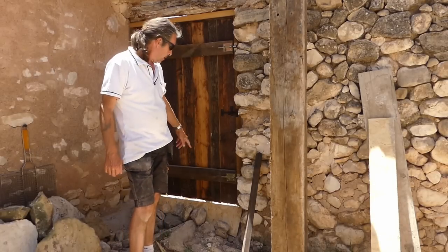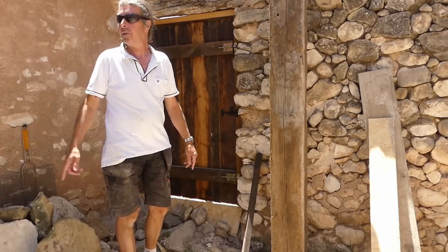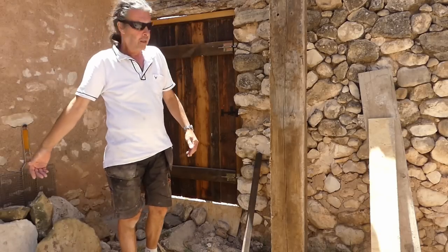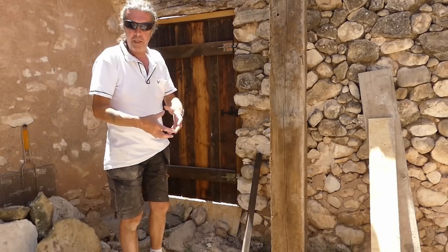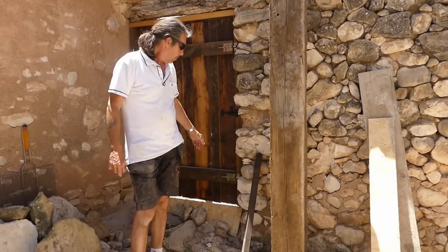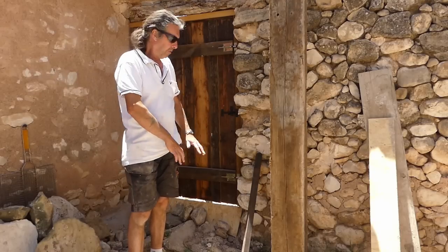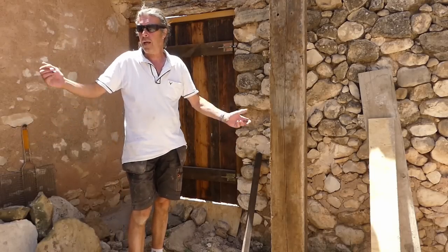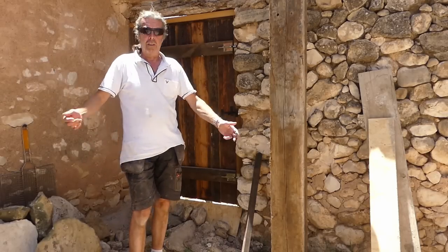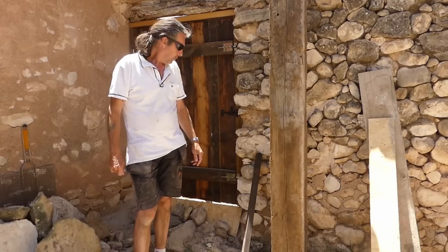We can't really do anything because of the pipe where the water's going to exit, and we don't actually get a lot of water coming down here because we have got gutters on the roof, but it will probably collect off this roof as well when that's up, so it should be big enough. I don't really want to put the hard plastic thing in because it goes quite brittle and it might break, but that's perfect. When I get that in first, I'm going to concrete it up to join this chute here, so all the water will go down there. If it backs up a bit, it takes a bit of time to empty it. If we get really heavy rain, it doesn't matter. That's the first job. Luckily it's getting too hot anyway now to be out here in the sun, digging and mixing concrete and stuff like that, so we'll pick it up in the morning.